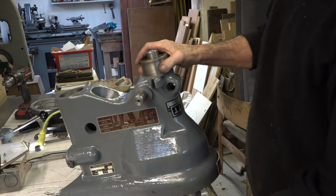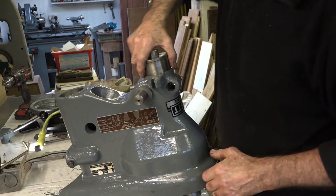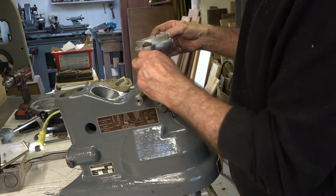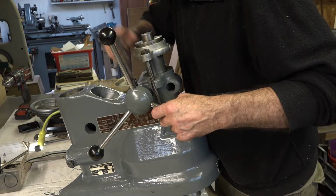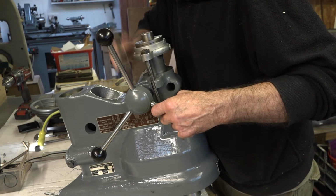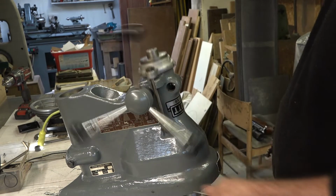So I've fitted the spindle, or the quill, back in. That's where your chuck goes on there. That's ready to take the handle, the big spider handle, and I'm just putting the depth gear, the depth stop, on, sorry. I would say that's right. Yes sir, Bob.